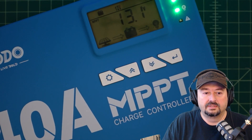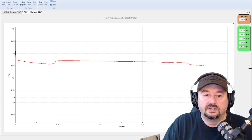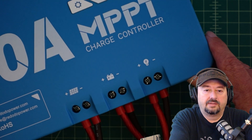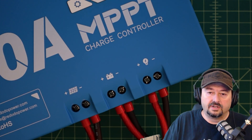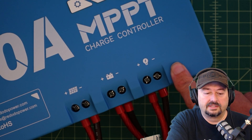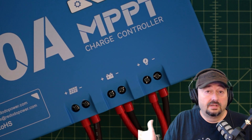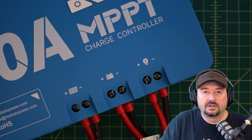Let's go back and take a look at the discharge test — this is our voltage over time, and you can see it's continuing to draw a load. I'll probably leave a load connected to this at all times, but I will run an inverter off of the battery directly since the load port is only rated for about 20 amps draw. When we're talking about 20 amps, that's not a lot for the things I typically run. So I'll connect an inverter directly to the battery and use the controller to keep the battery charged off solar — I'm a ham radio operator and this will power the bulk of our ham shack energy.